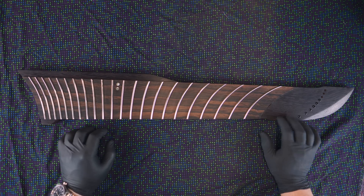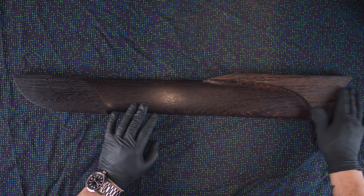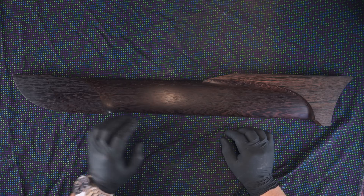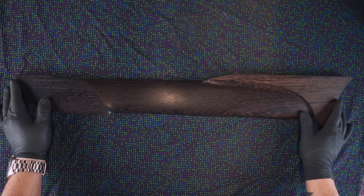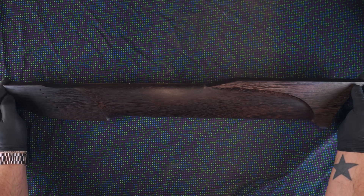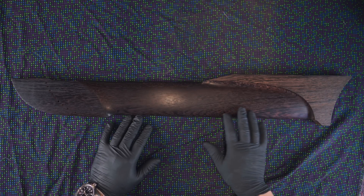The board has one coat of oil on it, and I did seal the neck itself. You have a lot of folks telling you when you're sanding your neck not to go with too high of a grit, but I disagree. I went up to about 8,000 grit on this neck until it looked like glass and felt like glass and was shining. This is one coat of true oil. It feels magnificent — everything on this neck feels like glass.